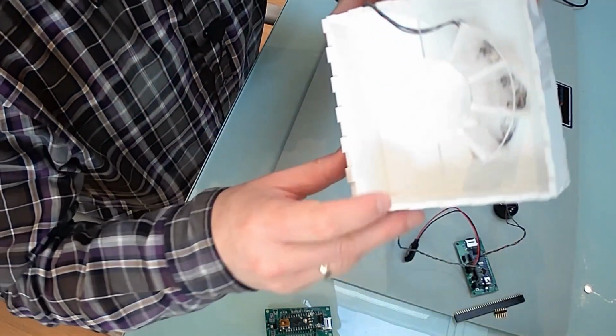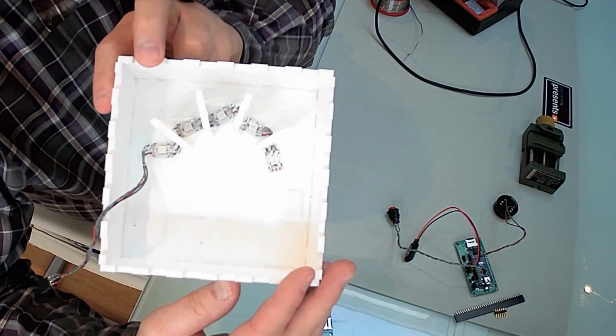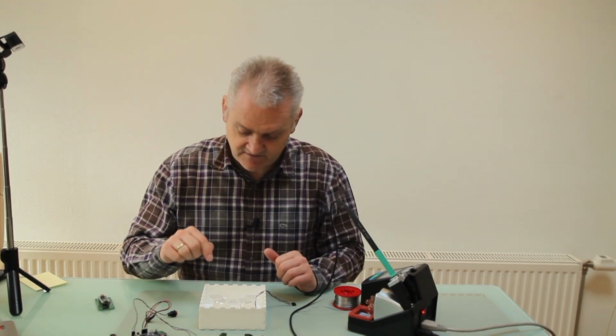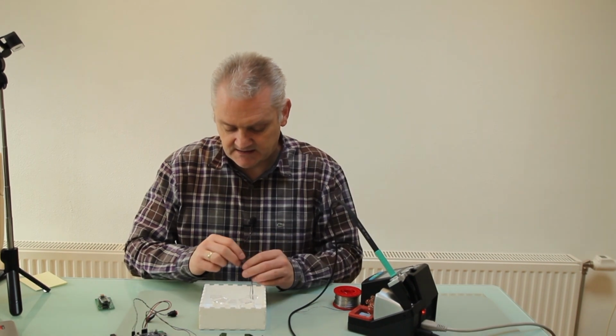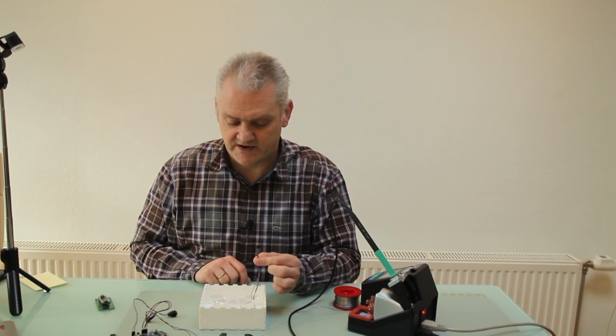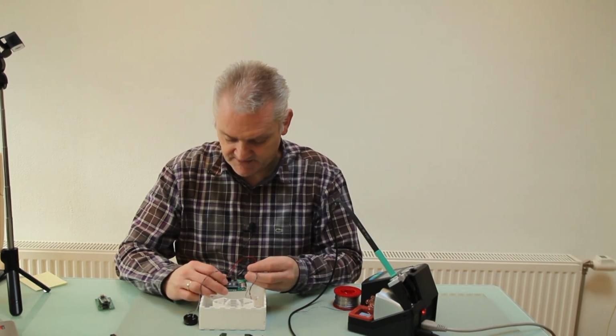As you can see, I cut up the pixel LED strip into individual LEDs, and I glued them to the bottom using the adhesive tape on the back, and I just connected them again with individual wires. And at the beginning of the pixel LED string, I attached some longer wire with a connector that I can just slide into our PCB.